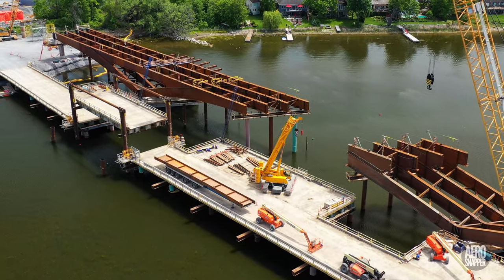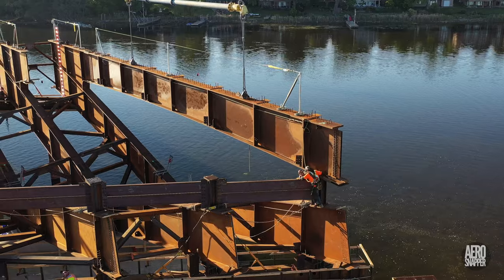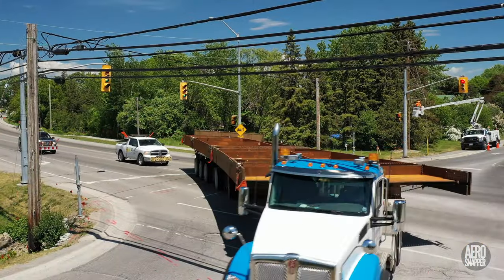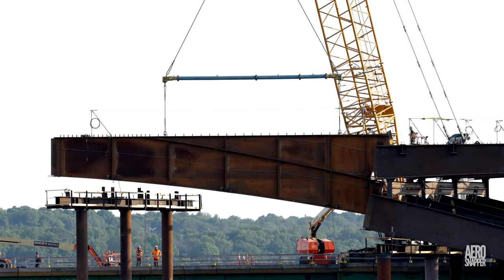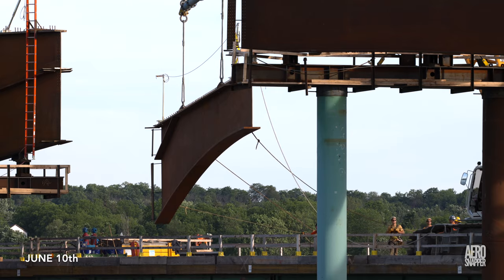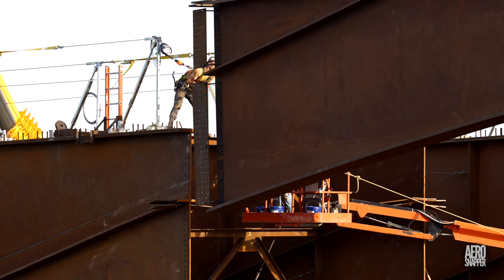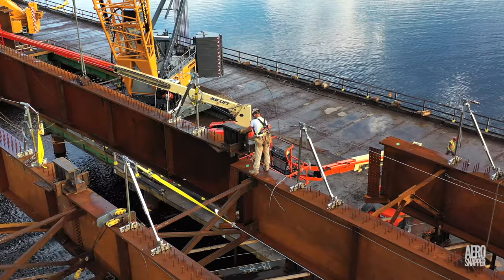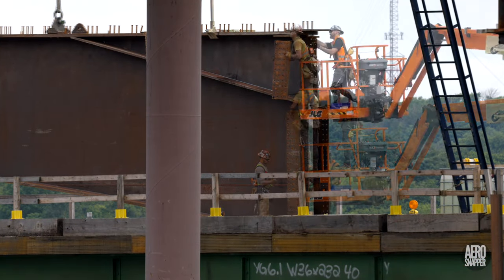Note the two beams waiting on the trestle. Rather than bridging the obvious gap, these will push westwards directly over pier 18. A second beam is swung into place the same day, while up on Highway 15 more steel is arriving and running down Gore Road. These massive web sections will run from bent 6 to bent 7. With that section in place, it was time to bridge the gap between bents 4 and 5 — a ticklish task, with joints at either end that must match perfectly. It's a great testament to everybody involved in the production, processing, and installation of the beams that they rarely needed any adjustment. Careful preparation and meticulous attention to detail probably played a large part in this achievement.